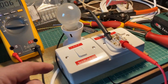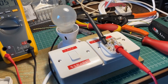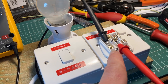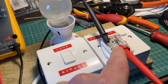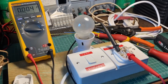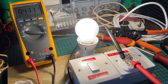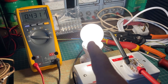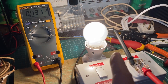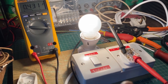The light bulb is in series with your device under test. In this case, I've got a dead short — basically a device going through an open plug — and I'm measuring that on the meter. As you can see, switching it on, you're getting full mains voltage, basically measuring the current going through just the bulb, and it's plateauing at 0.4 amps. This is a 100 watt bulb.